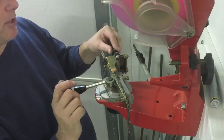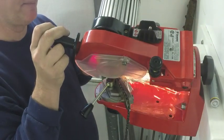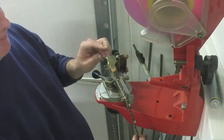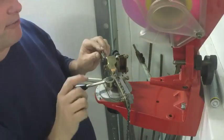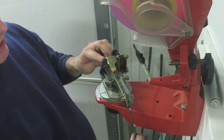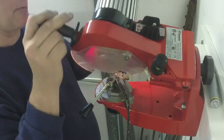I'm back to the one that I magic-markered. I'm just going to turn that a little tighter and go around a second time. You don't want to discolor your links by taking a huge amount off that side — just do a little at a time. So when they're really beat up, just go around them two or three times. You keep after them, once is enough normally. The first time you run a chain in dirt it'll be dull, so if you can keep your chain out of dirt they last a lot longer.